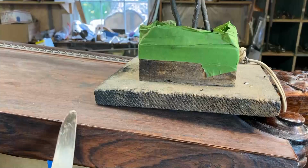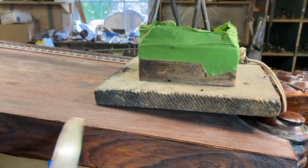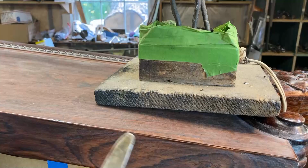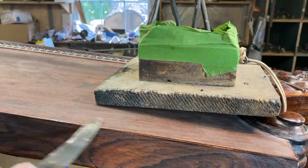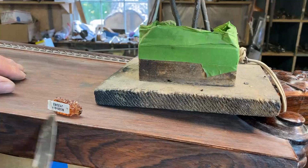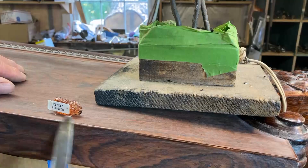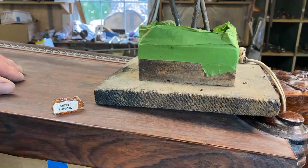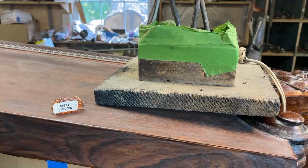See how it's hot, smoking already? You gotta watch this shellac. It's 126 degrees, you know, it melts. So if your knife is, it's gotta be a little warmer than that to melt this stuff, I think. But you gotta move quick. Don't stay there, just smooth it out. Like decorating a cake again, see?